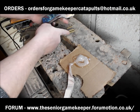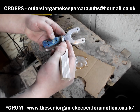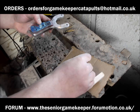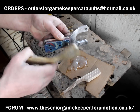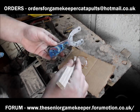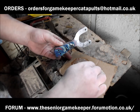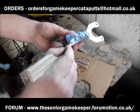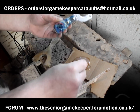Okay lads, drilled my holes, got my 4 rivets cut, mixed myself some epoxy glue up. So you pack the hole with glue — you can never get enough of this stuff; the more you can get in there the better. You can see that's filled the hole. Then get your rivet and roll it in there as well — it'll be a tight fit. You want it to fit tight guys, but if they're loose they'll look terrible if there are gaps around the rivets. Fill the hole, put some glue on the rivet, knock it in. Done this hundreds if not thousands of times so I can do it quick. Rolled in the glue.